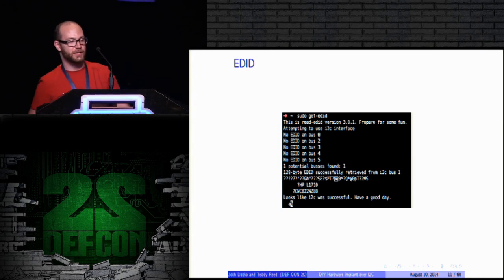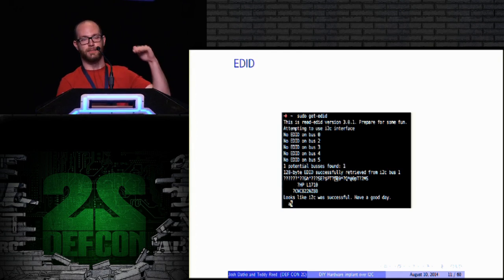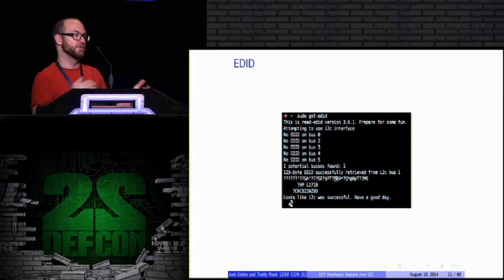Woo! All right. So think of EDID as like the next layer in the protocol stack above I2C. And there are drivers in whatever operating system you have for whatever video card you're using, or whatever system, OEM, independent service vendor board that implements the video adapter, that's running in software land, supporting this protocol, parsing it as it comes out of the display adapter or whatever you're attaching to, VGA, HDMI, so on and so forth.